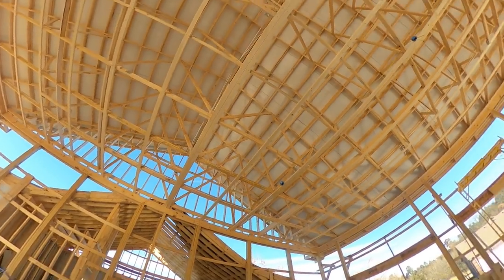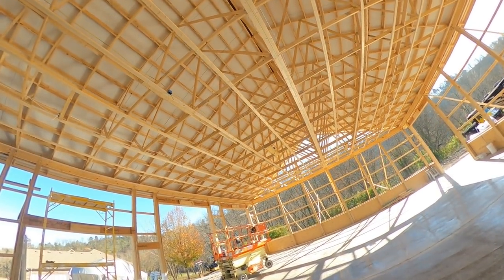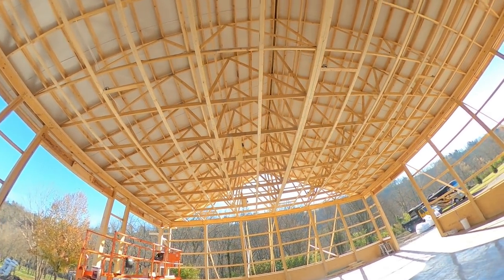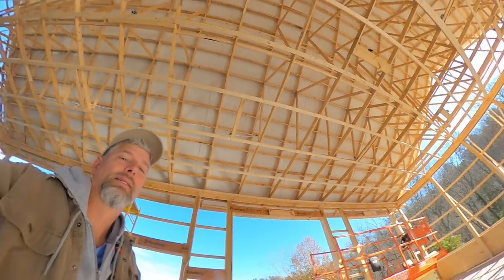All right, so let's get these fan boxes up, measured out, and put on there. That's the hard part. You know, just drill a hole straight up through the 2x4 to run the wires through, and I'll just go from box to box to box. And that's the plan.